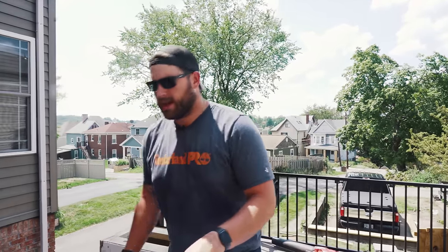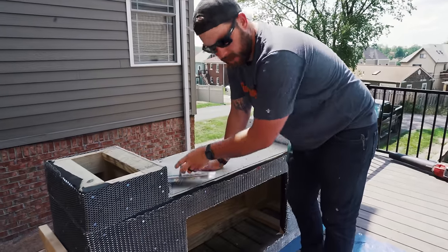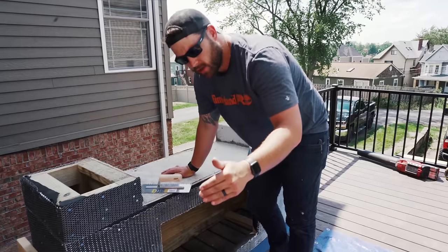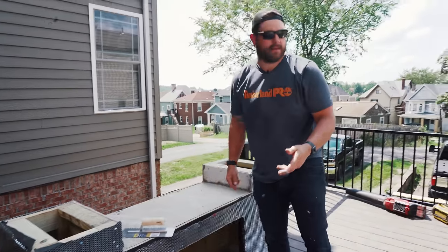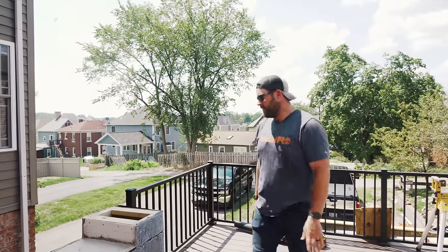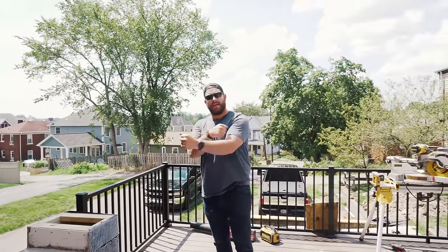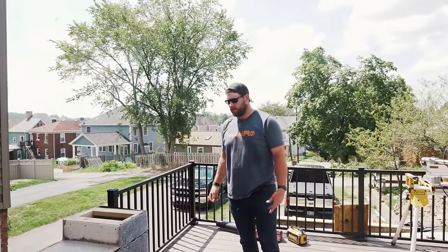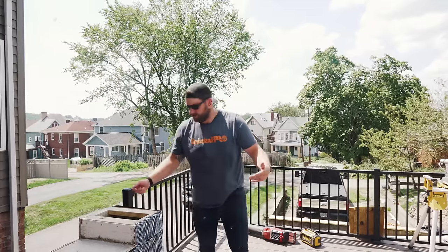Now that every one of us is bleeding from the fingers because this stuff is ridiculously sharp, we're going to scratch coat it. I'm just going to hit this with a coat of S-type mortar — higher sand content, I think. Whatever, but there's an S on it. If you're buying this stuff and doing something like this, talk to the person selling and get the products they suggest, just do what they say. If you're wrong, call them and yell — they're not going to do anything but it makes you feel better. Scratch coat, and then we'll come back and hit it with a trowel coat to get somewhere for this to stick to. And then we've got to let it dry for a day, which pisses me off. But let's do it.